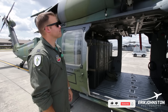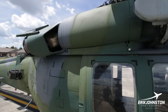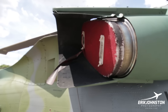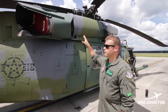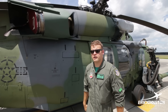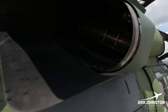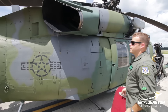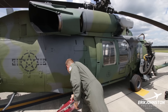As we move down the side, we've got the exhaust of the number two engine here. This is the HIRSS — the Hover Infrared Suppression System — a passive infrared suppression system for the engine. IR-seeking missiles like man-pads — the Stinger is a U.S.-made one — lock onto hot components like the aircraft exhaust. The HIRSS takes in ambient air and mixes it with the hot exhaust, and baffles it so we're not exposing the really hot engine exhaust directly to the outside world. The original UH-60 Alphas were basically straight-piped, and in later years they developed the HIRSS as IR threats proliferated.